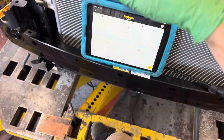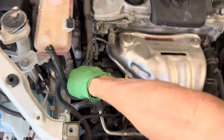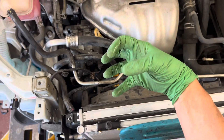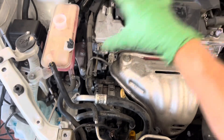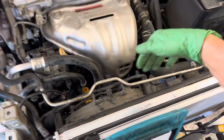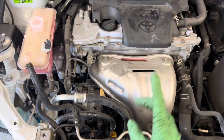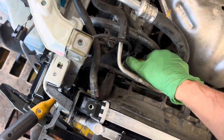Right down to where it goes into the compressor — that's all heat energy picked up through the aluminum lines and a little bit of rubber. That's wasted energy that the compressor has to compress and the condenser has to reject, because of heat picked up by the metal lines in the engine compartment. It would be even greater on a hot summer day in Utah, Arizona, Texas — 105 degrees outside, 250-degree coolant air going into the engine compartment, hood closed, stop-and-go traffic. You're losing a lot of your capacity just from the refrigerant lines.